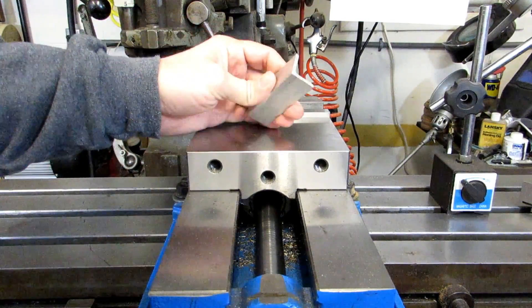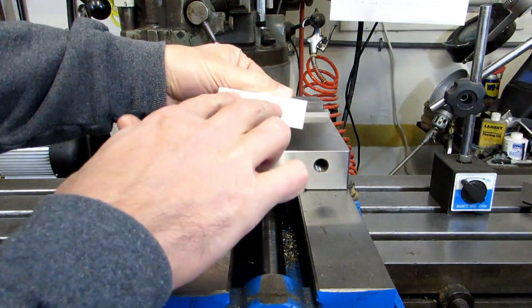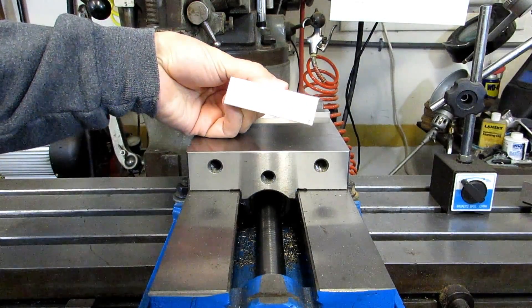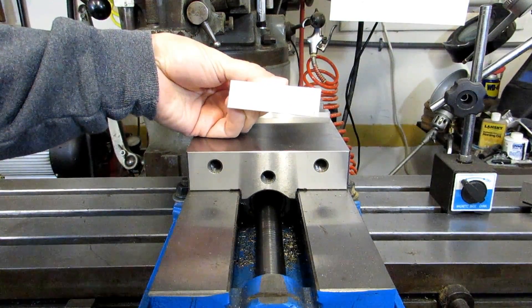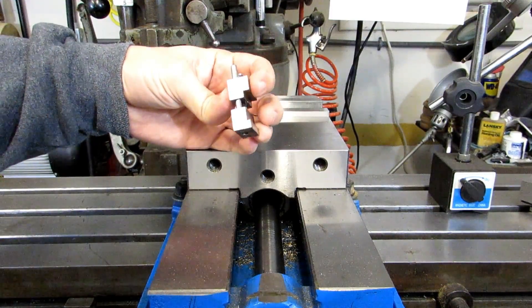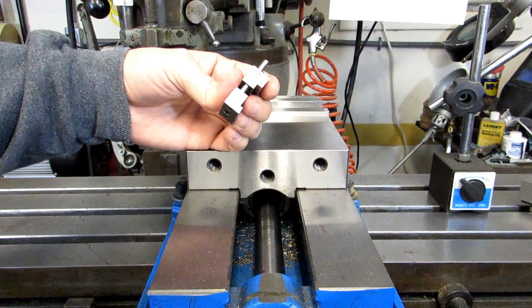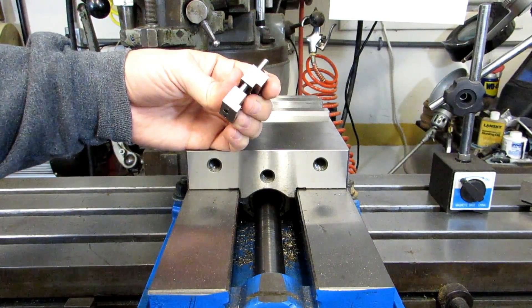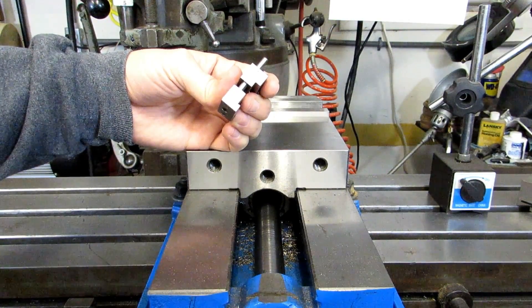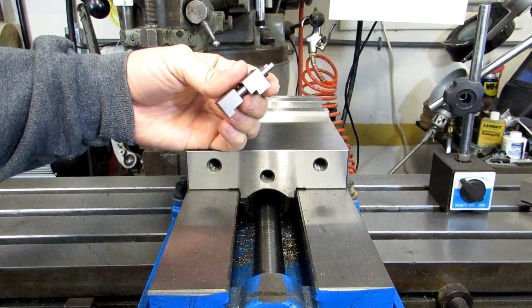The part I have to make is a bracket for the X-axis reader head and I've got to cut a couple of slots here and a couple of slots here. Since I'm changing my setup midway through I'm going to use a vise stop so I can bump my part up against it. I'm going to show you a quick trick using either a marker or grease pencil that is going to help you keep track of your original zero — that's one of the hardest things about machining without a digital readout.